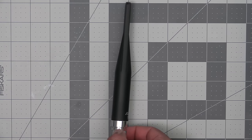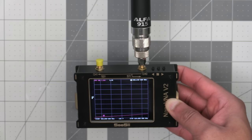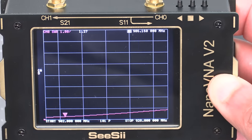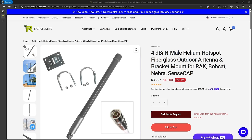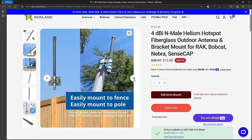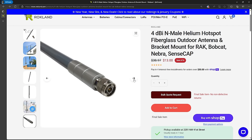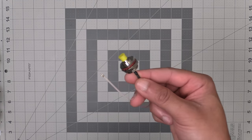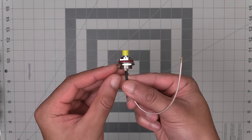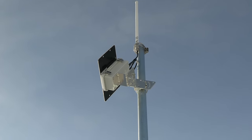Another improvement is the antenna. Rocklin Technologies has a small, inexpensive 5 dBi 915 MHz antenna from Alpha, and I've tested this — it has great SWR in the 915 MHz range, so I'm now recommending it. Since it has an N connector it's more robust. In case Rocklin sells out, there's another small antenna I feel should be small enough to safely mount directly onto the enclosure, though it seems to be lost in the mail at the moment. Every antenna I've tested from Rocklin so far has been great, so I suspect this one will be no different. For those who'd still prefer an SMA connector, I found a good SMA mount with an O-ring for waterproofing instead of cutting your own rubber seal like the previous version.